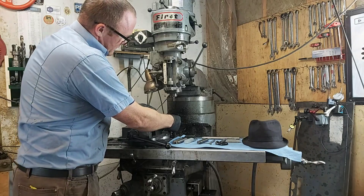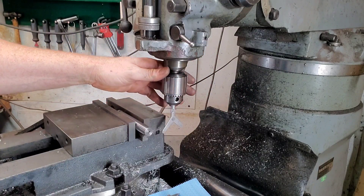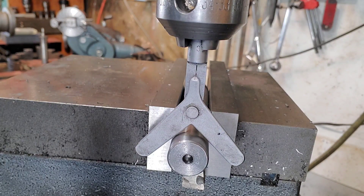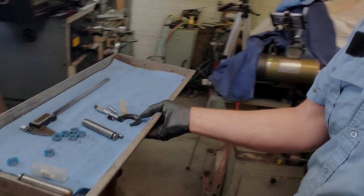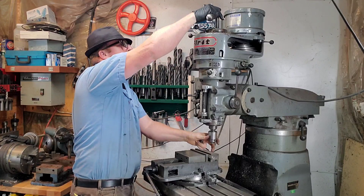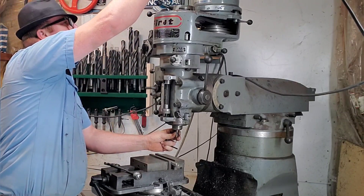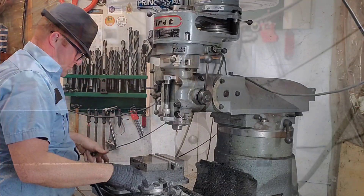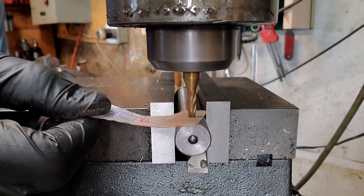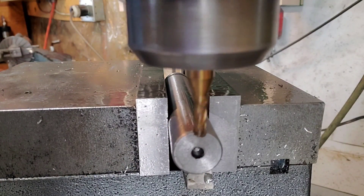This type of keyway is just a positional one and it'll actually allow it to track because there's a bit of play in there. This is one of my favorite tools in the shop — the center finder. You stick it in the drill chuck, move it over until the line lines up, and you're within two or three thou of center. Let's grab this tray, get it out of the way, and then we're going to start making some chips on the mill. What I'm going to do is slowly bring the table up until it spits the paper out, then move it up three thou more and set my dial to zero — that's going to give me the height off the top.